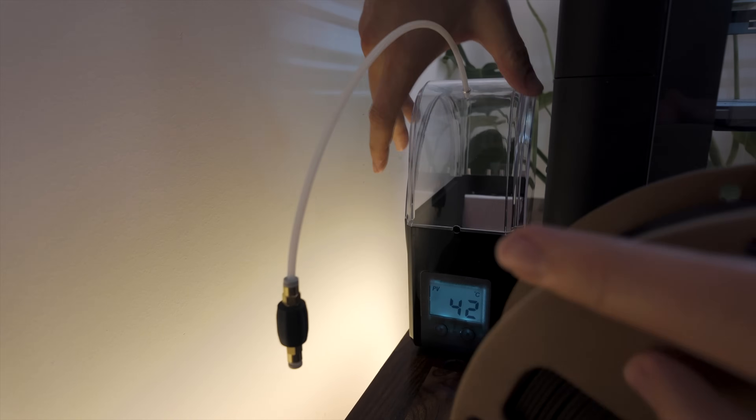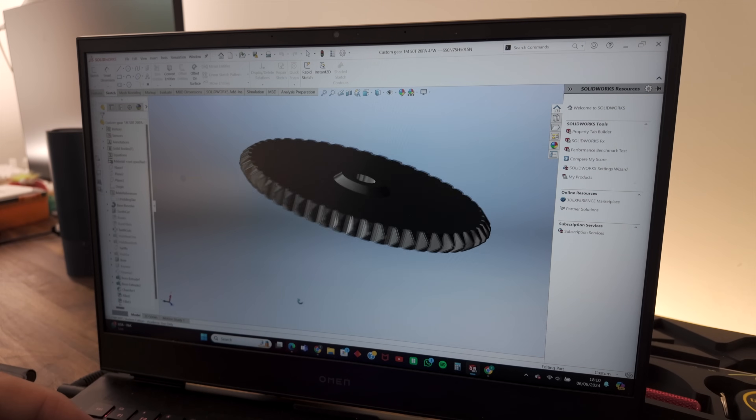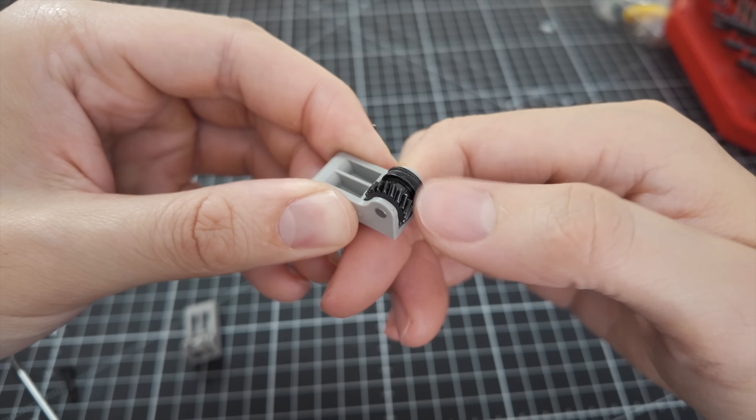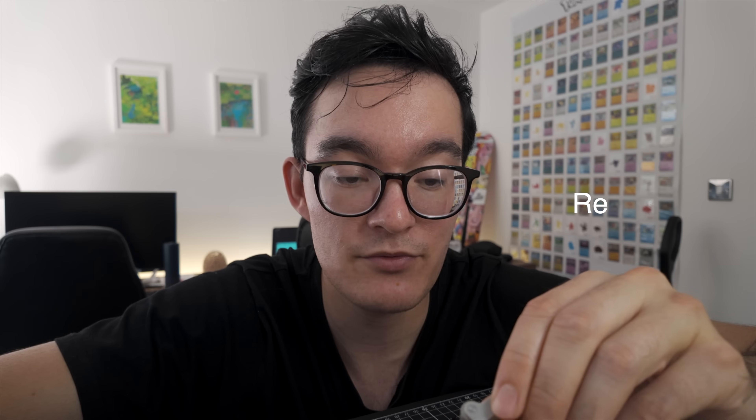We still have to print the nylon and see if that works. We've got the filament dryer running and our nylon just taken out of the vacuum bag — I'm going to pop this into the filament dryer and try to get this gear printed. I've applied a lot of glue because nylon's third problem is layer adhesion: it's got a low coefficient of friction and doesn't like to stick to anything, including itself or the bed. I launched the print — but we had a problem. The extruder gear I swapped in isn't actually spinning. I think I've been sent a faulty gear, so I'm going to reinstall the old one. Yeah, after all that. It's printing — let's see how it does.